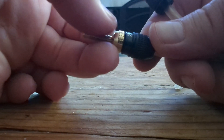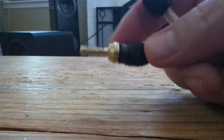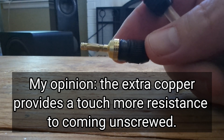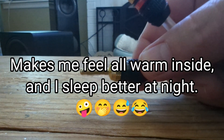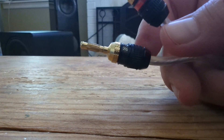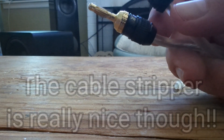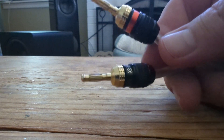See how easy that is — it's not going to come apart, nice and strong. You just twist it around like that and it makes the engagement a lot easier. If you make it just long enough to fit without twisting, the engagement's not even as strong. I like a little more wire in the connection — the part that cranks down and holds it. That's why I do it; it means I don't have to perfectly measure each cut. Just give that little twist and that's really all you've got to do.